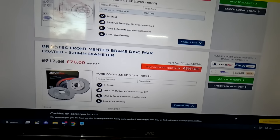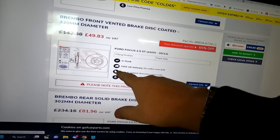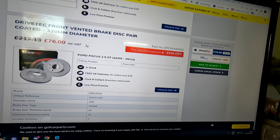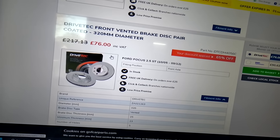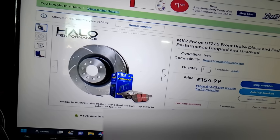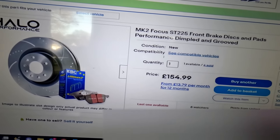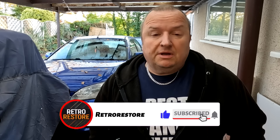I'm online — GSF are doing 65% discount at the moment. They do have 320mm discs but those ones aren't grooved like the ones on the car. I went onto eBay and found the actual ones fitted to the car, with the same groove and dimple formation, plus EBC pads — £154 for the lot. I've ordered them so I'll have to wait for them to arrive. That's all I can do for the moment; I've come to a standstill until the parts arrive. Just a little tinkering video this one — see you in the next one, bye for now.